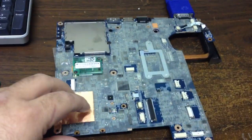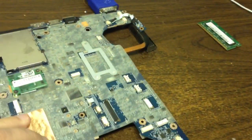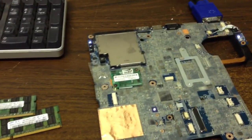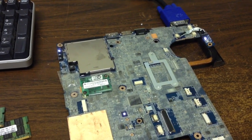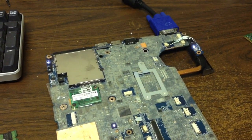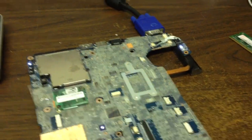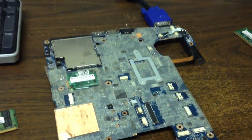In the course of our testing here, we've hooked everything back up and put a 512MB stick in there. We're going to turn it on and see what we find. This is just a simple test to make sure you're not going through the whole entire reball or reflowing process just to find out it was a stick of memory that was bad. We see the light still on, so we're going to turn the system off, hook it back up, and try a different CPU.